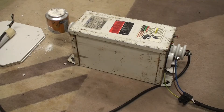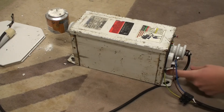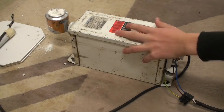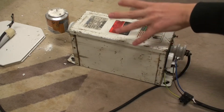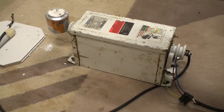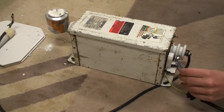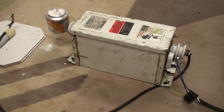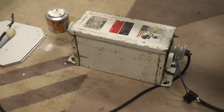It's actually quite simple to wire one of these transformers. You have your chassis ground here — basically a screw connected to the case of the transformer. It is very important that you connect that, otherwise you might have some voltages on the case. Then usually on a small bushing like this you have your mains input terminals, and then there are usually one or two big bushings — in this case one here and one on the other side — those are your two high voltage terminals.